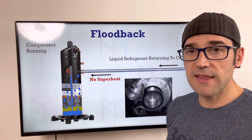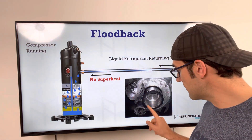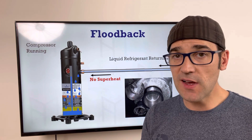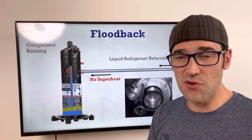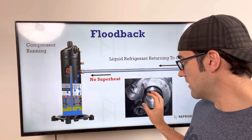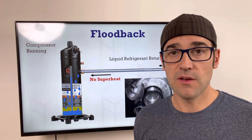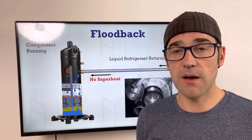If you have major flood back happening constantly, that liquid refrigerant gets up to the top, dilutes the oil, you get metal on metal — and this is what it looks like. When you cut open a compressor and you see this bearing just bare like that, and this bushing and bearing damaged like that, that means 100% it was flood back. Unless you have full signs of overheating — which would look cooked and very dry — this case is definitely flood back. An inspection makes it easy to tell.